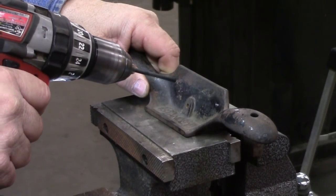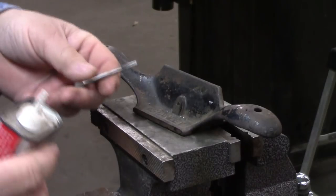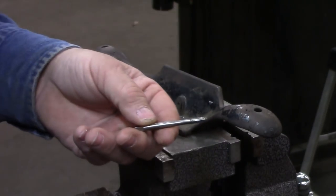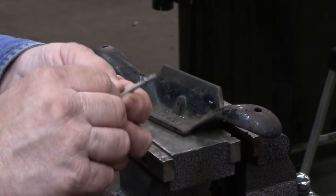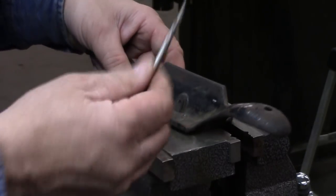So don't get mad at me — I'm going to drill out these three holes to a number 12, or was that 3/16ths, and tap them out and use just regular machine screws. Basically I'm just reaming the threads out and going to cut a set of new threads, but these will be standard American standard threads.